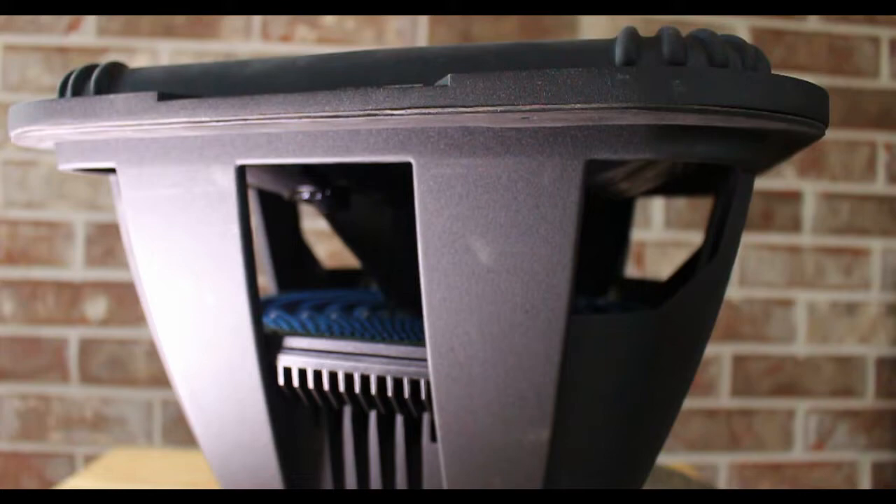Now let's go on to other specifications for this QL715. As discussed, 1200 watts RMS without an issue. Looking in the owner's manual: Fs resonance frequency of 31.8 Hz, sensitivity at 1 watt/1 meter of 87.26 dB, Qts of 0.74, Qms of 12.37, Qes of 0.79, Re of 3.61 ohms per coil, Vas of 2.59 cubic feet, and Xmax of 21.5mm. Power handling of 1200 watts RMS.